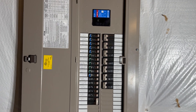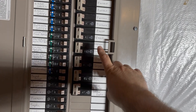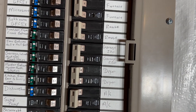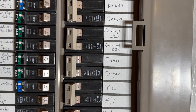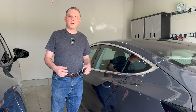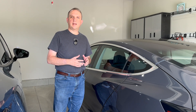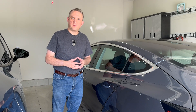In order to do this, our electrician added a 40-amp 220-volt breaker. The electrical code dictates that the maximum you can use is 80% of a breaker's capacity, meaning we can draw 32 amps at 220 volts, or around seven kilowatts. The cost for us was limited as a new build, but the average cost in the United States to add an EV charger is between $1,000 and $2,500.